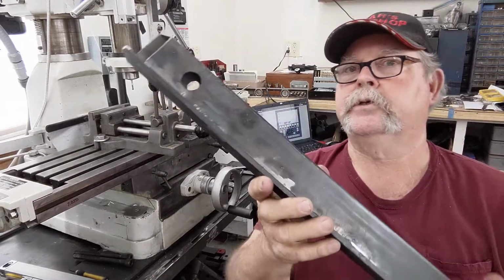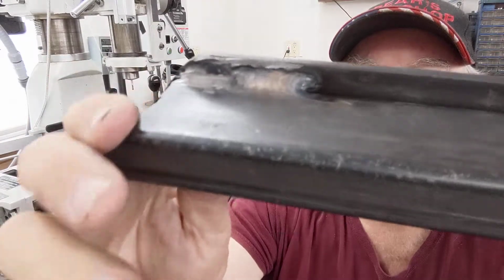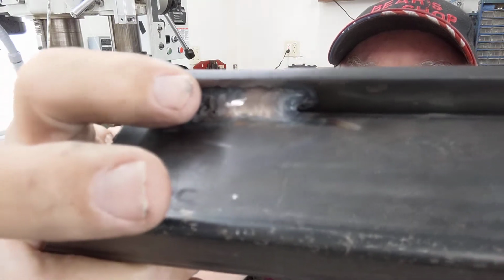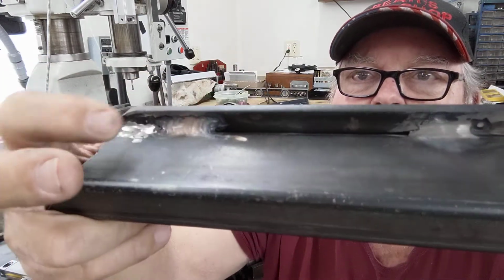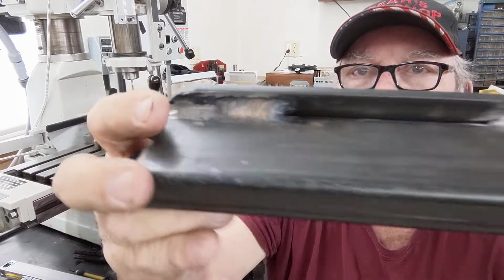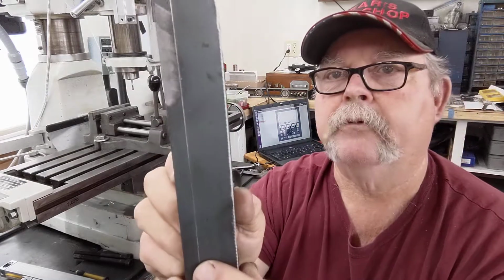But here is that plate. Now, TIG welded in. Yeah, I need to get a little practice because I got some undercut here. Running a little hotter, running about 130. Should have been running around 115, but got a little undercut. I'm not going to worry with it, but that would fail a welding test. And this is a 1/4 inch, 1.5 inch plate.